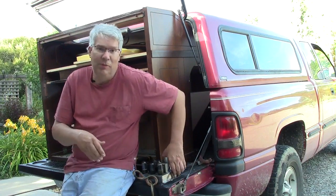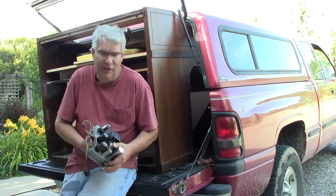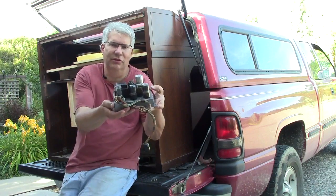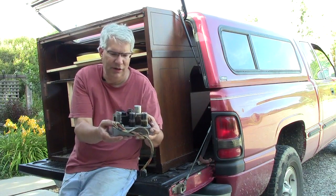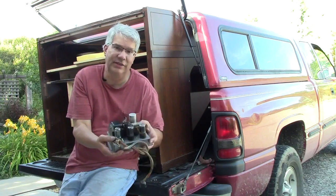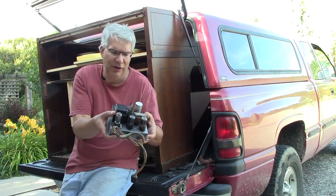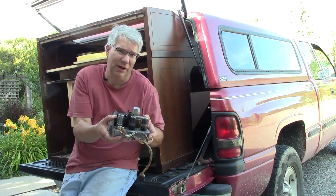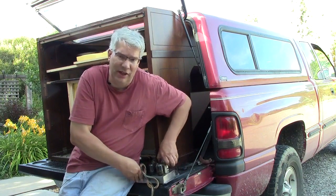First thing I'll show you is the low power amplifier. It came out of a Bendix console radio that Jerry had. Somebody had given it to him, and I went over today and he had basically pulled out this little guy here. This is the power output for this Bendix radio, and this is 6K6 output tubes, push-pull configuration. Here's the power transformer and the OPT. This will end up putting out about 3 watts. So on the low power side, I got that covered.